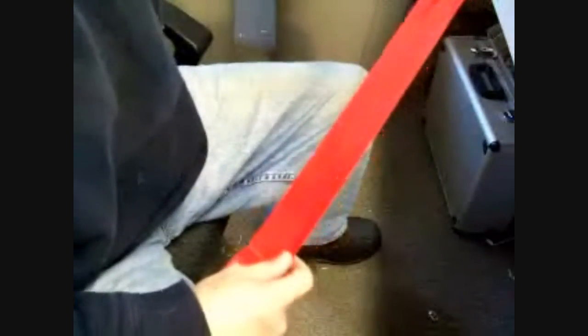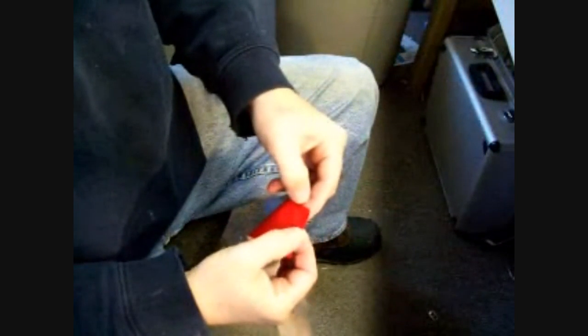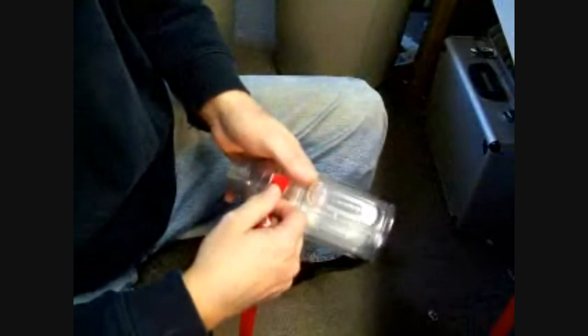Take a piece of tape a little over a foot long, look at the end of it, about right there, about 5/8 of an inch, rip it off. So you got a nice straight piece. I'm going to use the factory edge on the bottom. Check, make sure everything's lined up just the way it's supposed to be, and start that tape right on that line.